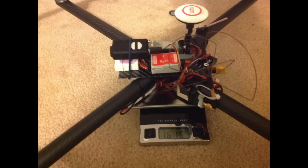As you can see, I'm using my Mobius for recording and live video out. It goes to my Team Blacksheep plug-and-play 25 core, which provides charging capabilities to my Mobius, so it continues to charge my Mobius while I fly and takes the live video out from it, and it also supplies power to my video transmitter. The weight reading on the scale is the actual all-up weight of the aircraft as I was flying FPV.